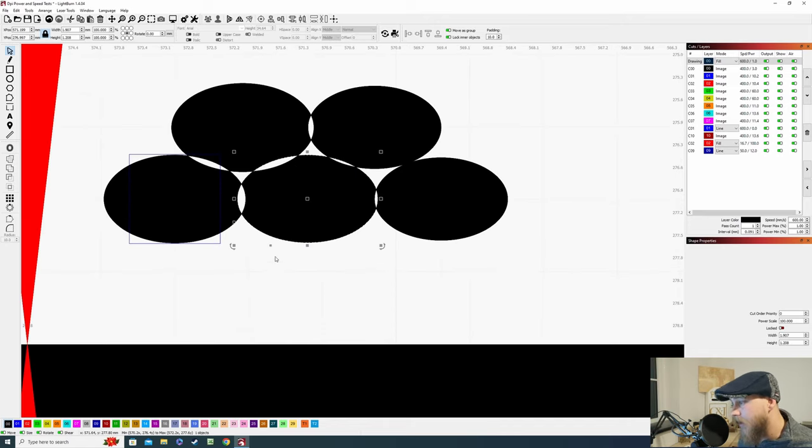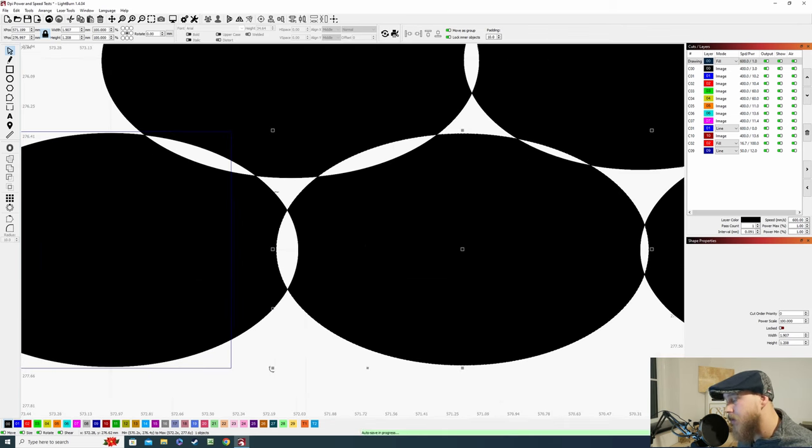When it comes to defocusing the laser, slightly enlarging the dot means it starts covering up those white gap areas between dots. The effect is better when dots are overlapping slightly than when they don't overlap at all.